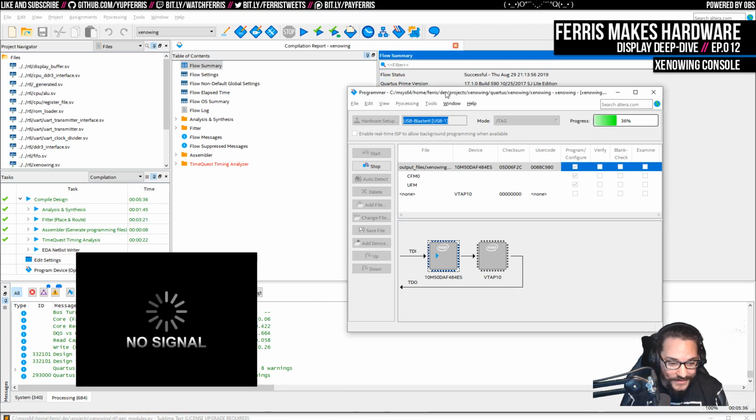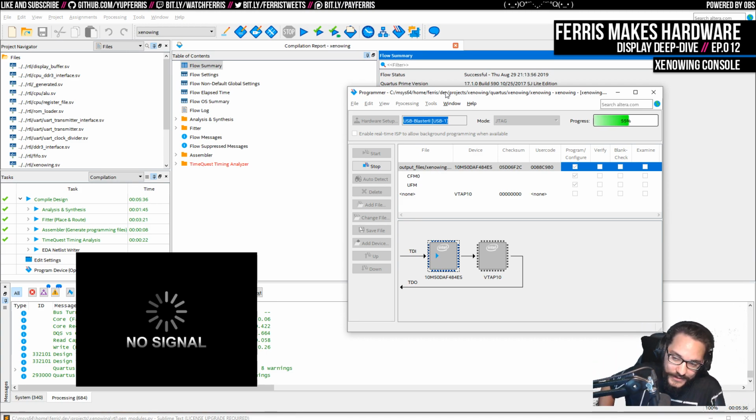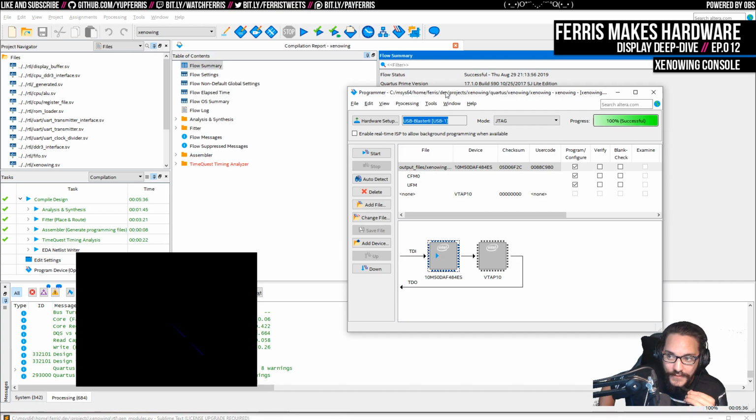Yeah, that'd be nice. I was actually thinking about that, if I make my own simulator for my hardware language. Because my hardware language doesn't do multiple clock domains, it doesn't do tri-state logic, or even 4-state logic, as is common in Verilog. And I mean, Verilator doesn't either, as far as I know. So that should be fine. But with those assumptions in mind, okay, look, this works.